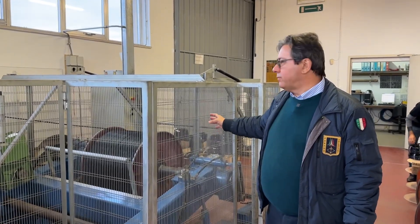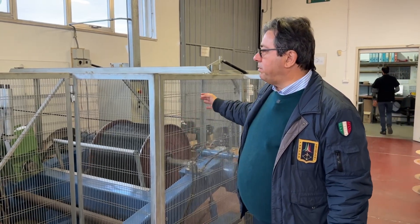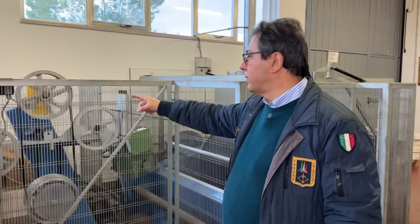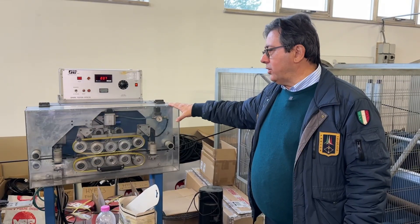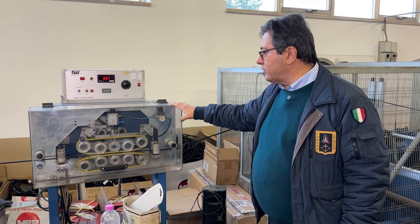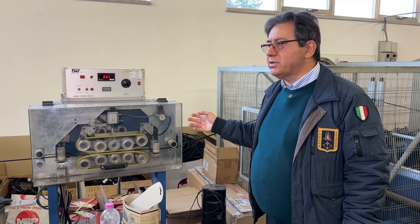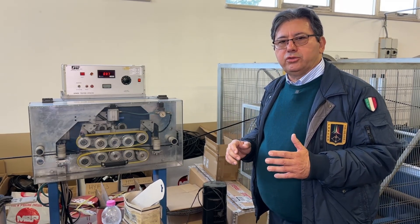Here again, we've got the payoff. The payoff is electronically controlled — it will pay off the cable gently with an acceleration ramp, passing through a compensator to make sure the cable is always pulled in a very gentle way. It's passing through here to a meter counter — a professional, industrial one — which allows us to automatically count the meters and stop the machine when we reach the right amount of cable to place on a roll.